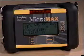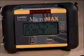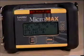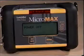Low battery warning alerts users that there is approximately 15 to 30 minutes left until the unit goes into battery depleted alarm. It is indicated by two short beeps every 15 to 20 seconds, along with the words low battery on the display. The battery depleted alarm is indicated by five audible beeps, the display of battery depleted, followed by shutdown.